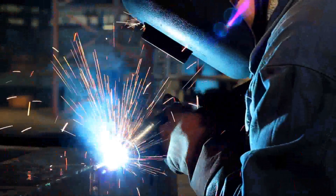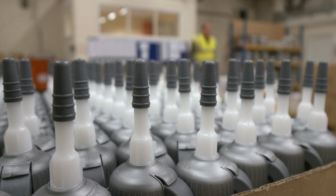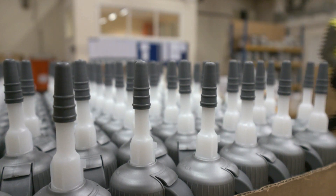Of the adhesive technologies, you have epoxies and polyurethanes. Epoxies are very high strength but low elongation; polyurethanes are low strength but high elongation. MMA has bridged the gap between those two technologies, providing a tough, durable, and impact-resistant bond.